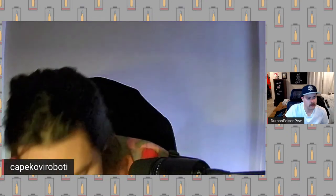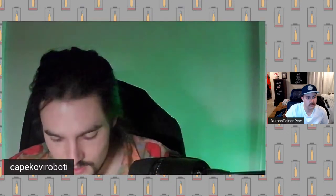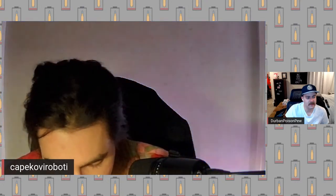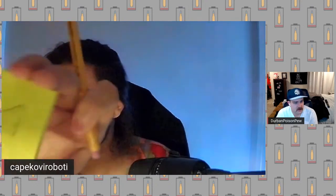So we've got our point for the nozzle. Then we are going to make another point with our pencil for the probe. So now we've got 2 points. Then we're going to imagine that we draw a straight line horizontally through one and vertically through the other, like this. There we go. And we're going to draw a third point where they meet. Now, what we've drawn is the base of a right triangle, where the hypotenuse is the line between the pin of the Z probe and the nozzle, right? So if you can see again, there is our little right triangle.